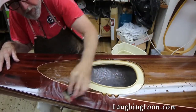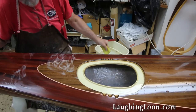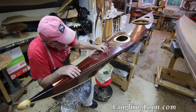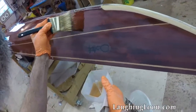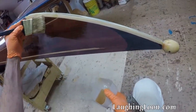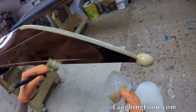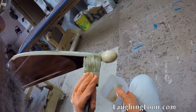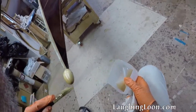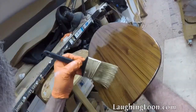That's just the first coat — after it you need to apply two more coats. So you need to sand again, wet sand, remove the residue, and do another coat. Wet sand lightly between coats to remove any drips or runs. The sanded surface between coats is important because it gives a tooth to lock in the new coat of varnish and shows you if you've missed any spots, which is easy to do. That's why we go with the grain, across the grain, and then with the grain again to make sure we haven't missed any spots. You want strong lighting so you can see the highlight of the lights in the varnish surface to tell whether you've got total coverage. And don't forget to varnish your hatch covers also.